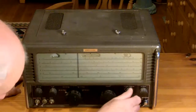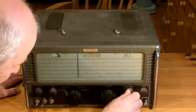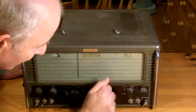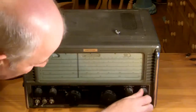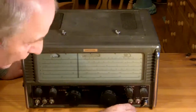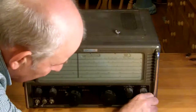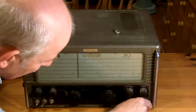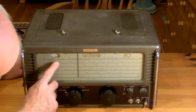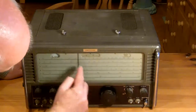Crystal phasing with an off position — it's marked but it's not clicking. I might have expected that to click into an off position. I don't know this radio at all in any depth, though I've always wanted one. There's AF gain — audio frequency gain — NL which is presumably a noise limiter, AVC for automatic volume control, and selectivity marked max and min but appearing to be in four switch positions. There's also an S meter.